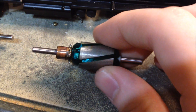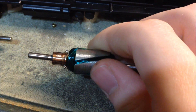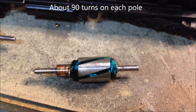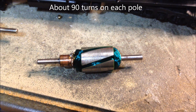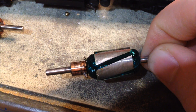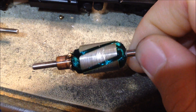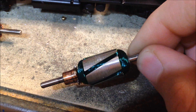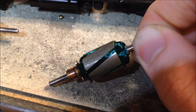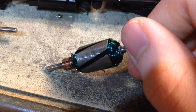This one here came from when they were still experimenting with the gold motors. It had fewer turns of the same gauge wire, so not quite enough torque. So I took all the windings off and rewound it just like the original windings were done, but it's 120 turns on every pole now. That gives it higher torque because of the extra turns, and it also gives it a little bit lower current draw.